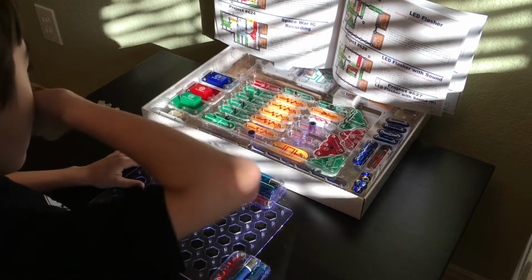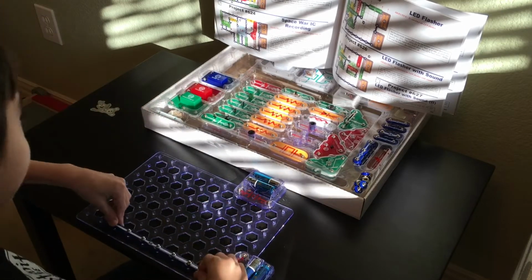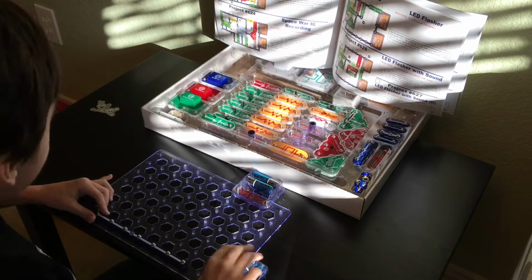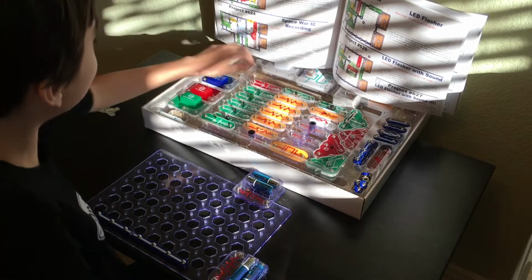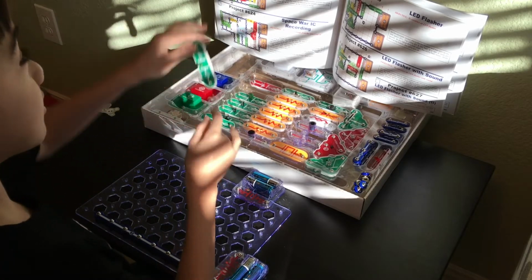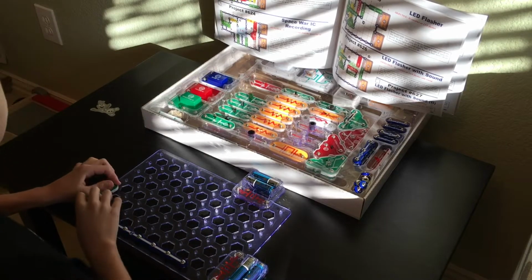Okay, now. We're going to be adding a huge long 7 that's going to be going over at G3, it looks like. G2. Okay. Now, we're going to be having the C1 capacitor. Couldn't see that. So this is 0.02 microfarads, very small. Orientation is critical again. It needs to be just like this, not like that. So it's going to be going way over at E1, on the side of the board.